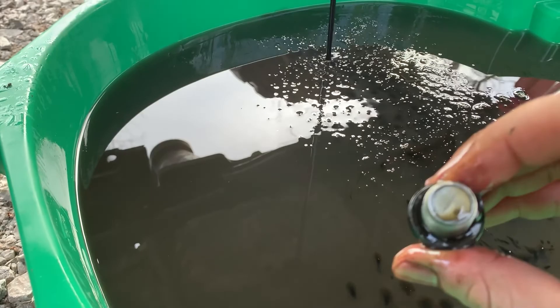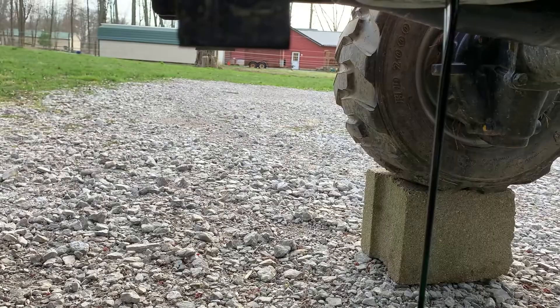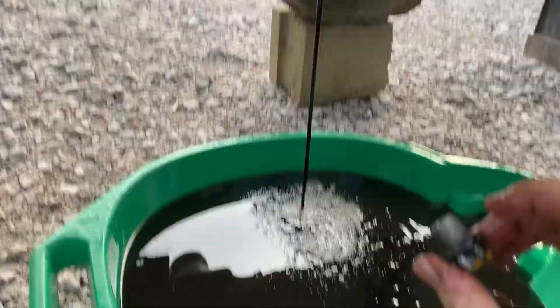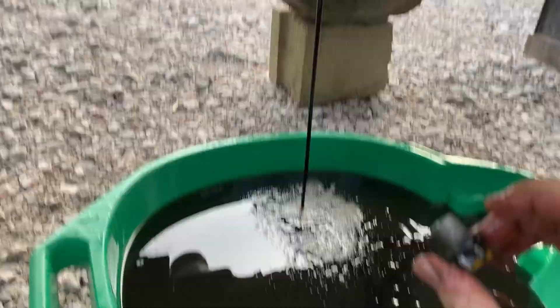Well, we'll let her drain. Give me a minute to clean up this bolt — just like the filter I showed earlier. Get some rags, diesel fuel, douse this stuff, wipe it down so it's nice and clean. Make sure there's no particulates or anything hanging out on there. And then set it off in a nice, clean, dry spot until it's done draining.